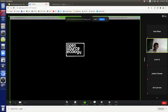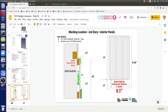Yeah. So what we're doing with electrical boxes, these are the junction boxes. We're gonna run those wires from the breaker box to that, but everything after the junction box is not included. In the module we are going to wire, we have that outlet. So this is the junction box, which is going to have a wire going to the outlet that's in the wall module.